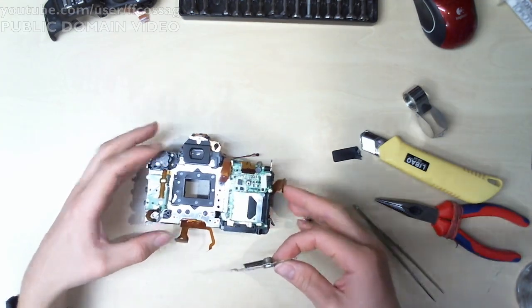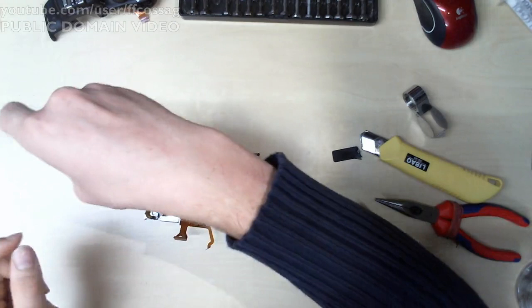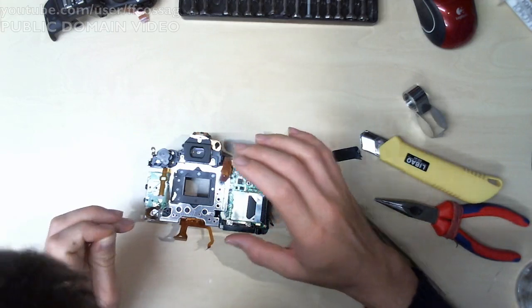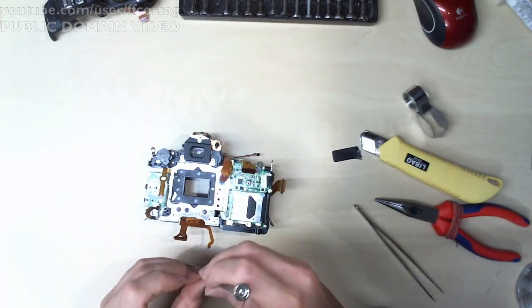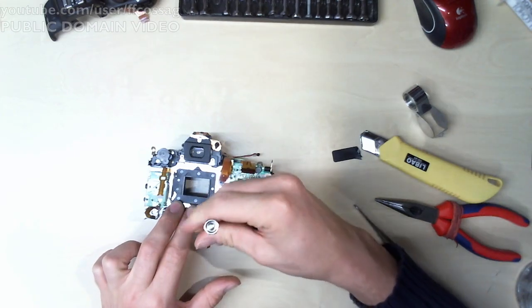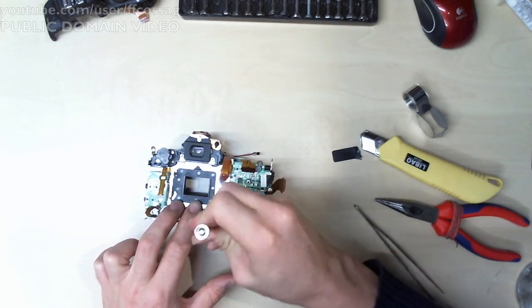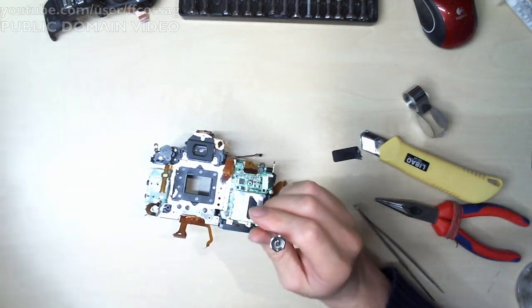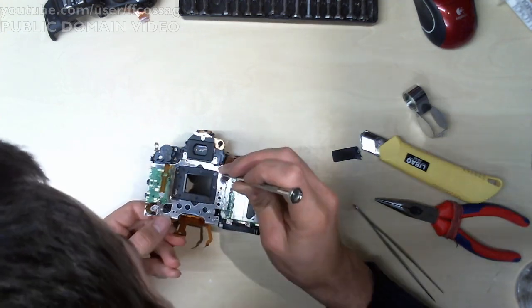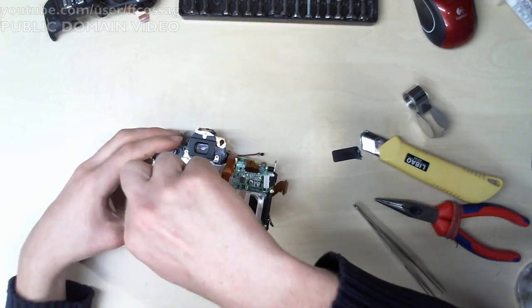And this, oh god, I need to attach that before I move further. Yeah, this is the part where it can get a bit confusing because there are many layers of screws and screw holes are very close to each other, so you could by mistake install a screw which is supposed to have the sensor mounts in between, and then you'd have to go back a long way to undo that in order to mount whatever's supposed to be attached by it.